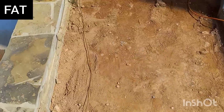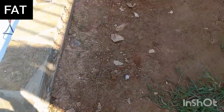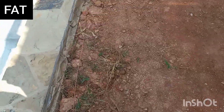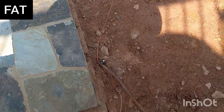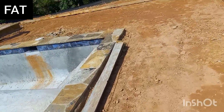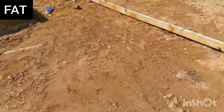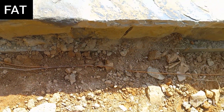We've got 18 to 24 inches. This one may need to move out just a little bit, but we tied to the rebars. We walk along and look and make sure, then move them if we need to. That one right there — beautiful, it'll be right dead on the money. Just have to move this bottom wire out a little right here. We are getting 18 to 24 inches all around. And right here is where we took the wire coming from the light and bonded it right there.